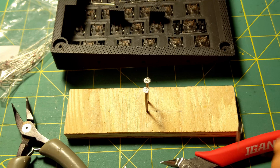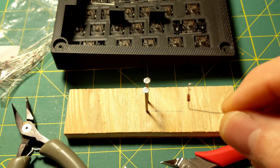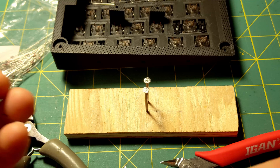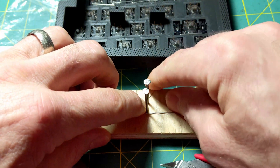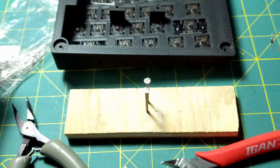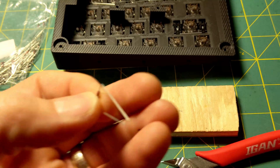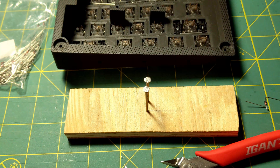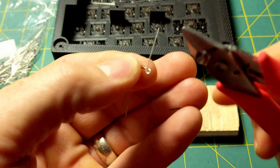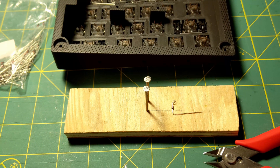For productivity with 89 diodes, I recommend doing each step in batches rather than one at a time. Shape all your diodes on the jig first, then go through all 89 curling the ends, then go through all 89 with your wire clippers cutting the ends off. Using muscle memory through repetition on each step makes the process go faster and keeps them consistent.